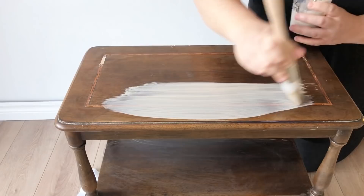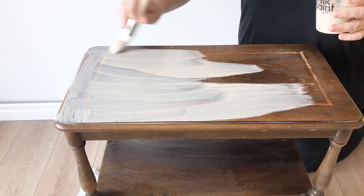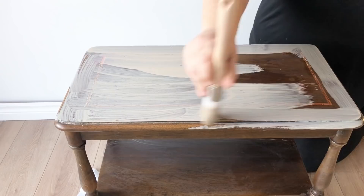Because milk paint is a lot thinner than most other furniture paints, the first coat — or even two — especially with a light color over something dark like this, can look a little scary. You also want to be really careful to go back around your piece a few times before you walk away and check for any drips. If you catch them before they're dry, they will brush out really easily.